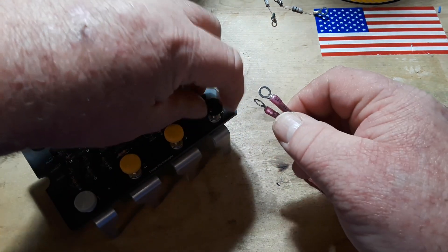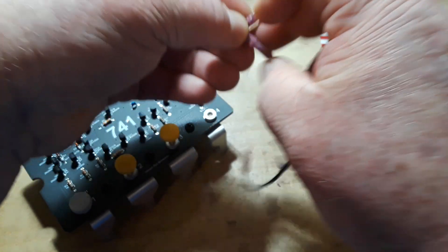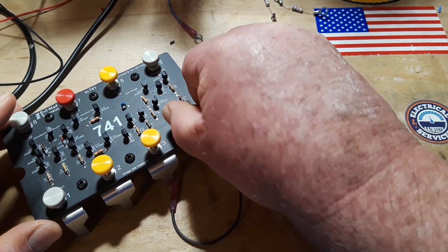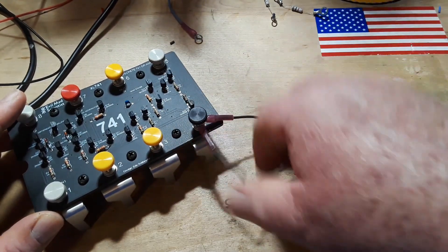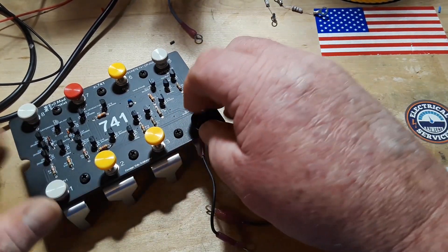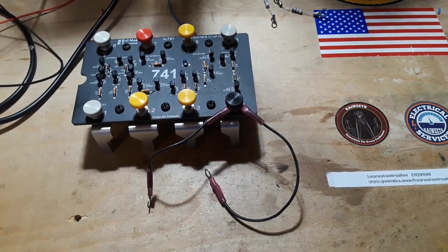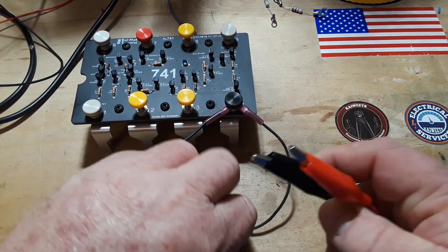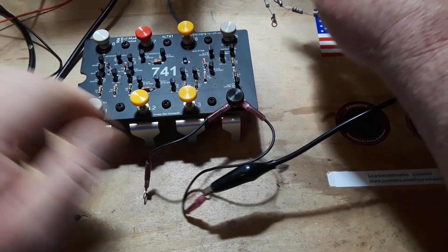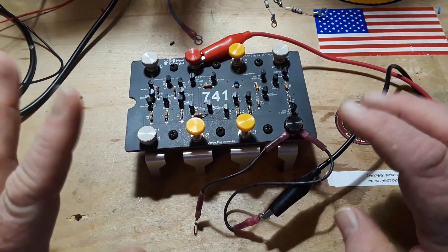Let's start with these grounds here — see how nice that fits? As you guys know by now, SolderStick is a sponsor of the channel, currently the only one, and I'm cool with that. I ain't looking for any more, because without all the sponsorships forcing me to do what they want when they want, I'm more at ease just creating my own content — which is how I started this channel. There's our grounds. Next up, we're going to add power from the power supply. There's our negative on pin 4 and our positive on pin 7. I don't have the power supply energized, so we're fine.